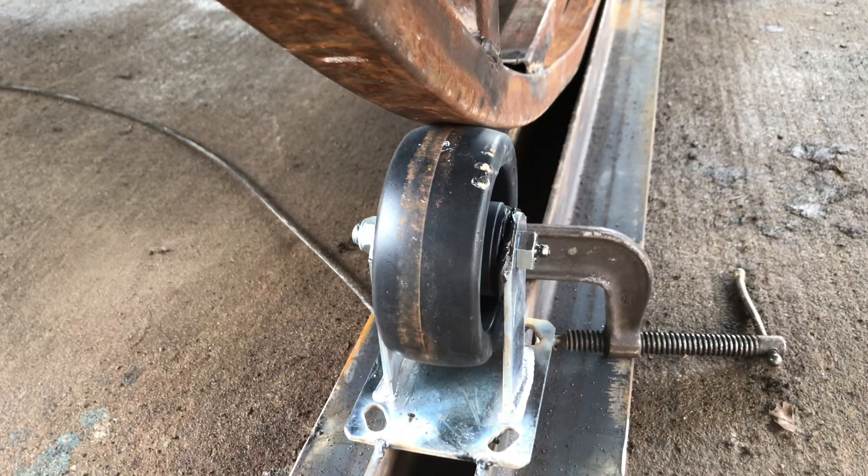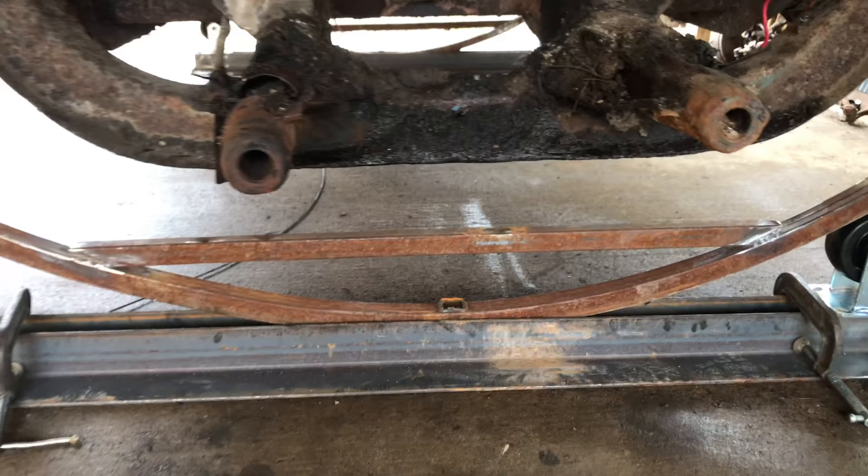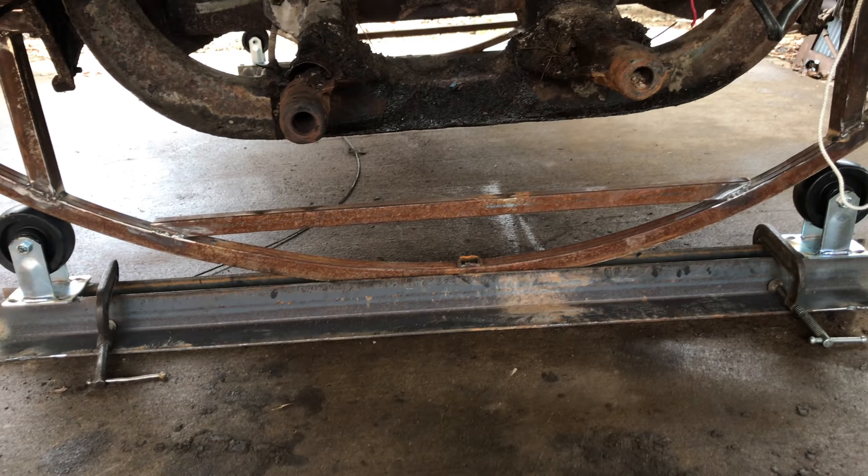When I made them I checked level this way, but they're not perfect — they're off about an eighth of an inch. So when that comes around, I need a little wider wheel. Dad went this morning to the local hardware store and found some that seemed to be much better. So I plasma cut the first attempt off and re-welded, actually moved them in a little bit too, and made the ring sit further out of the pocket. I raised the pocket a little bit so we have no drag on the concrete at all. Live and learn — first rotisserie build. Sometimes you just have to learn the hard way.